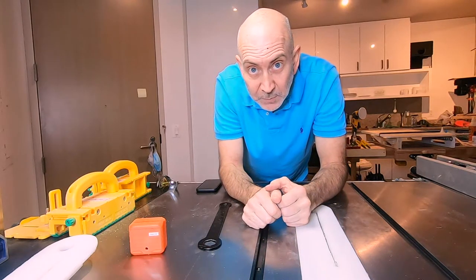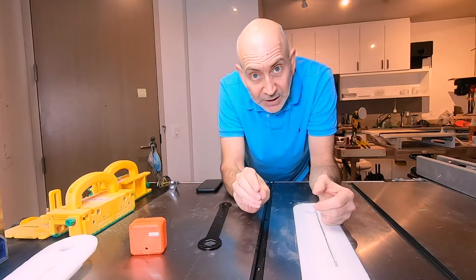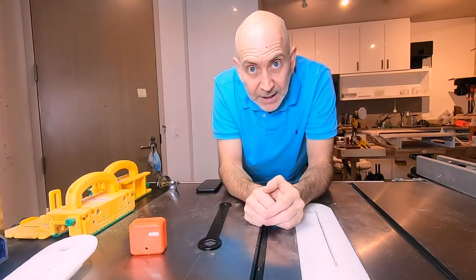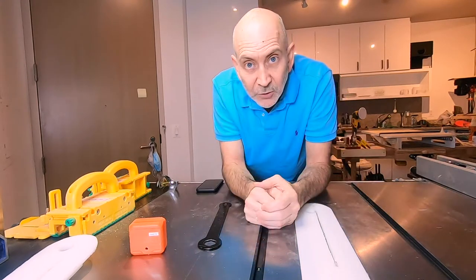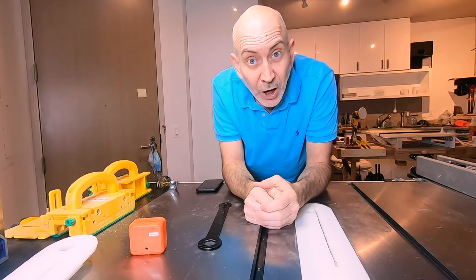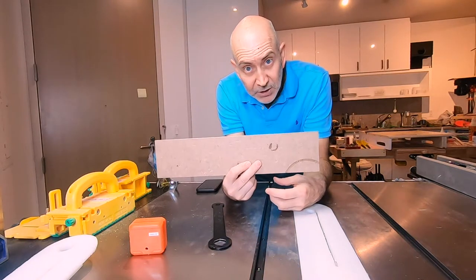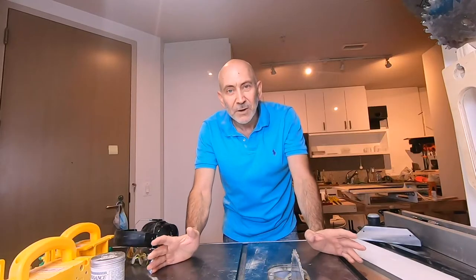If you have a three-quarter-inch piece, it depends what you're trying to do, but it might be like an eighth of an inch high in the center across 30 inches. And I address that in one of my videos on making a large sled. So you might also try MDF core plywood, which I think is probably a really good option for many people. And you're just going to want to get some MDF, just to mess around with, to make blocks with, to work on cuts with, and you'll have everything you need to get started enjoying your new table saw safely.